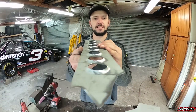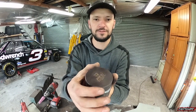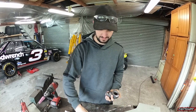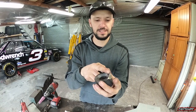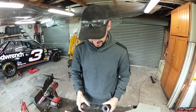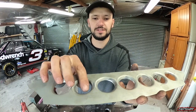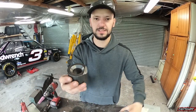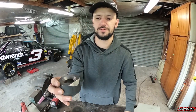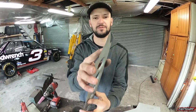It turned out pretty sweet with the dimple dies. I did have to modify my dimple die a bit - the problem with these is it's got a large flat surface on the outside, which helps when you press it flat, giving a nice conformed shape. But it also means the dimple dies have to be quite far apart - about 57mm centers, which is further than what I wanted. I like them close so each dimple reaches almost straight into the next. So I ended up cutting a flat face on one side so you just move along that edge.